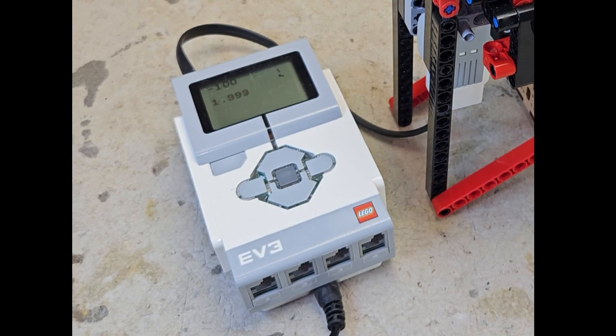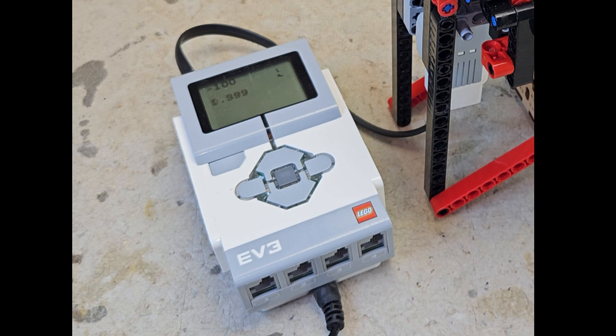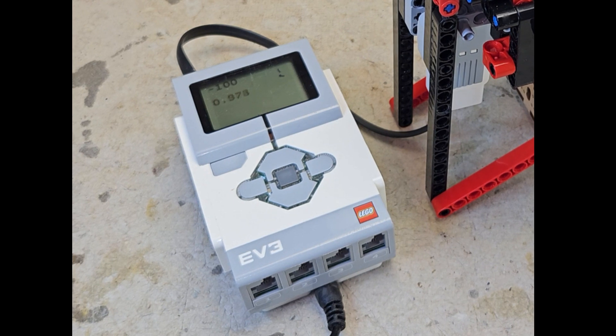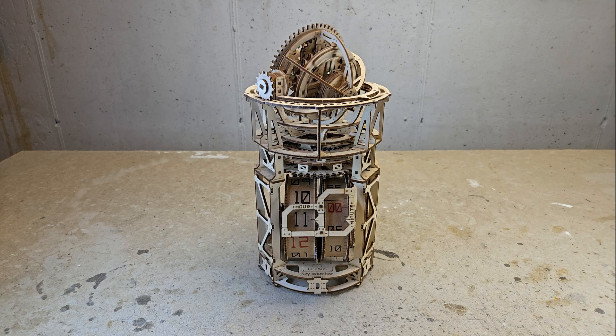In this close-up, you can see at the top that the servo motor is running at 100% power. The power output is being measured every 2 seconds, and after each check cycle, the counter resets to zero. Once resistance is detected, which shows up as 99% power output, the servo motor stops and the counter will continue counting up until it reaches 90 minutes.